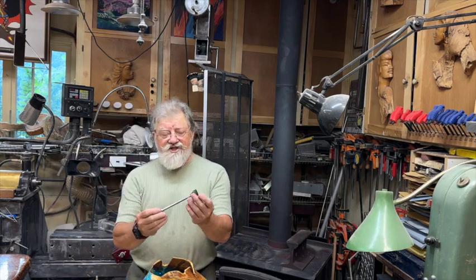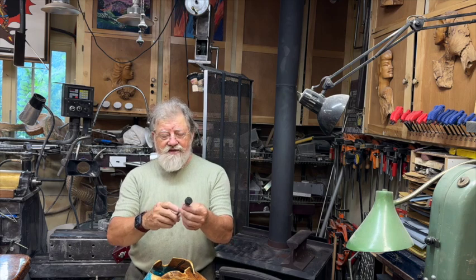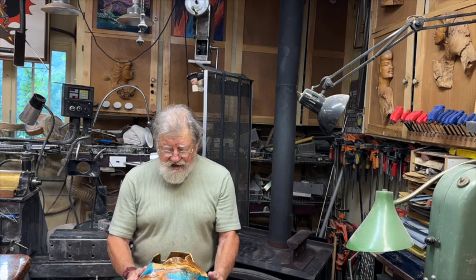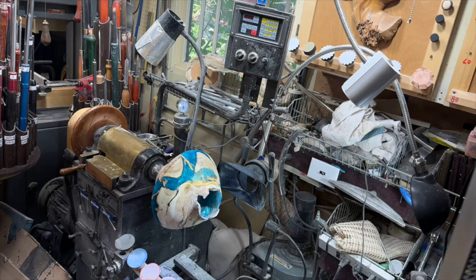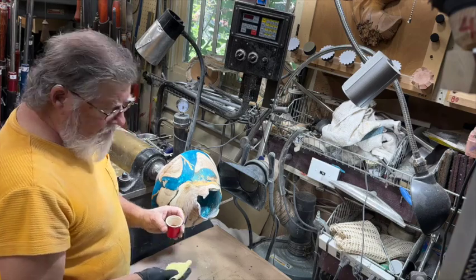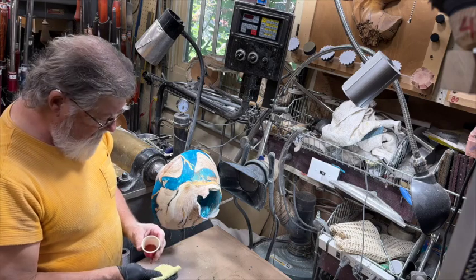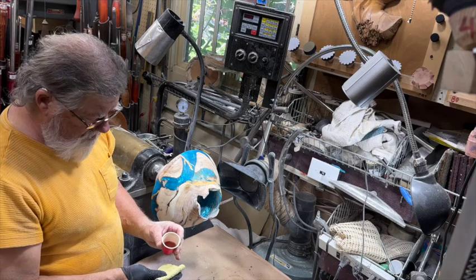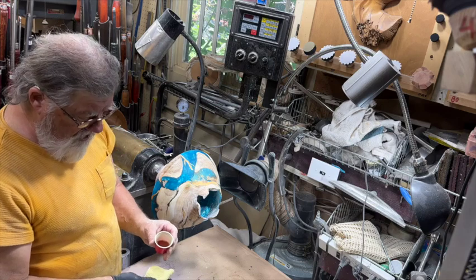Here's another extension made specifically for sanding — it's got velcro on the top and comes in three different lengths. I started the sanding inside at 40 grit because it was quite rough, and ended up at approximately 600 grit after hours and hours of sanding. It's time for the final coat. This finish is one part boiled linseed oil, one part polyurethane, and one part pure tung oil. The only place I found pure tung oil right now is Lee Valley.